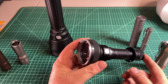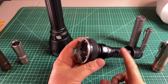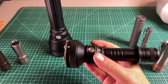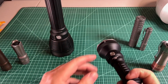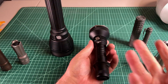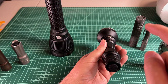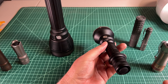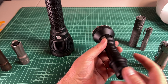Unclicking the mechanical switch on the Acebeam doesn't cut power — this light will drain since the e-switch is still receiving power. But I really like this interface. It's neat to have an e-switch for mode switching but instant turbo at the back. Also, since signaling with the e-switch would be a real pain, having turbo on the back lets you tap out Morse code. And since I'm barely tapping the back switch and it lights up before a full click, it's a forward clicky — which makes perfect sense here.